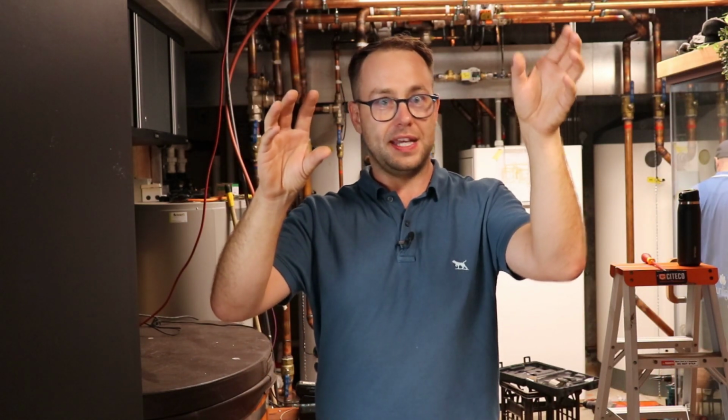So we found, for example, that here, the heat pump is producing hot water and cold water simultaneously. When it was trying to get rid of, let's say, hot because it had no use for it, it was supposed to divert that to the bore, to the ground connection. And what was actually happening was that the three-way valve was sending it into the cold water. And so the cold and the hot water were mixing. And basically, all the energy that was being produced was being lost, and nothing was happening at the end of the day.